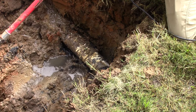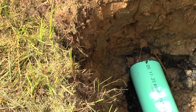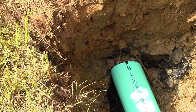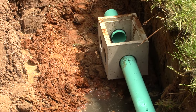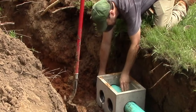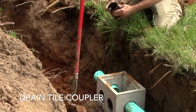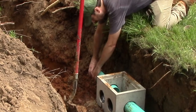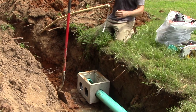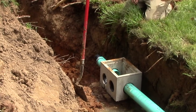Different codes in different places say different things. We do have a sanitary elbow that comes up from the lower part of the tank — that's the old school way of doing it, but it'll work just fine for us. We have solid SDR 35 coming out just to our distribution box. We're going to pipe it out two different ways into the most level part of the property. We'll bring this short piece of pipe out and push all the little things in here and shove it in the end of our pipe. We're going to hold it on with a little piece of duct tape just so it doesn't keep pulling out, since we can't really glue it. The blue portion of the pipe will stick into the distribution box about an inch.